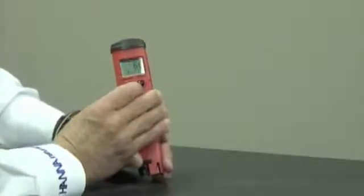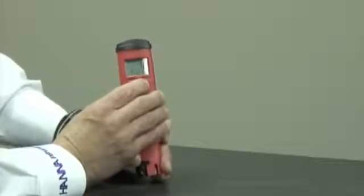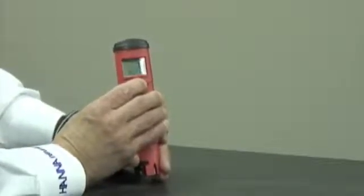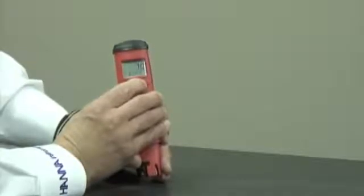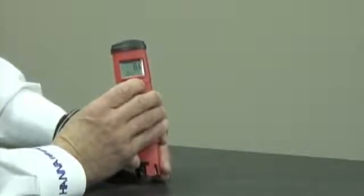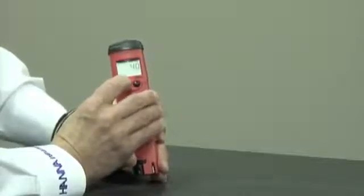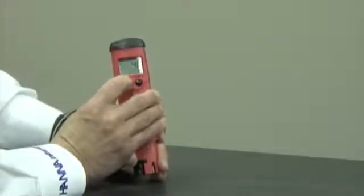I want to change my buffer set. I can toggle back and forth between 6.86 and 7. So in the case that I want 6.86 as my starting number, I'm going to toggle to 6.86 with the set-hold button, hit the mode button, and that's going to take me back into the measuring mode.